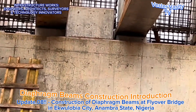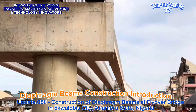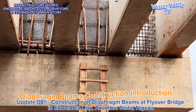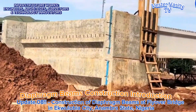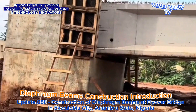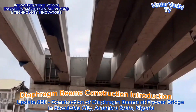I did not see any intermediate diaphragm beams in between the main larger beams or girders. Maybe the contractor will install them at a later date. Bear in mind that the construction of the reinforced concrete diaphragm beams is to tie and chain the lead or primary larger beams or girders together, so that all six larger beams or girders will act together as one unit, and thereby have the capacity to withstand the live traffic loads from vehicles moving on top of the bridge deck yet to be installed, and to withstand the lateral loads due to winds, earthquakes, and any other anticipated lateral or twisting loads acting on the sides of the bridge.